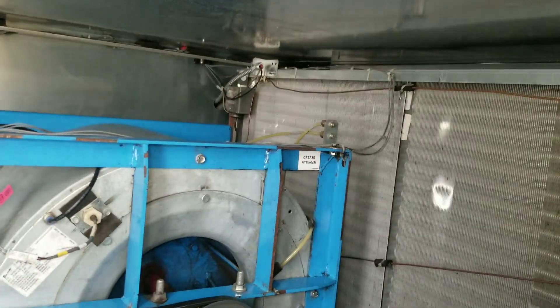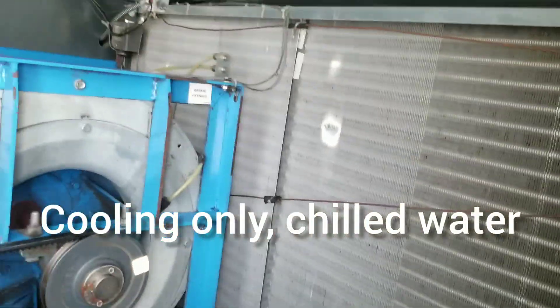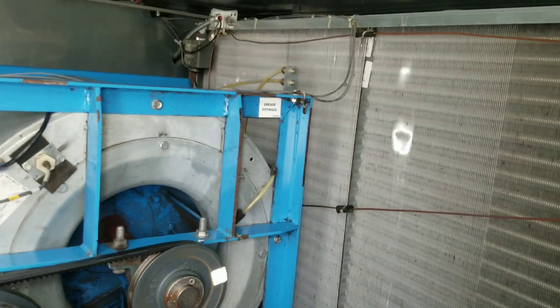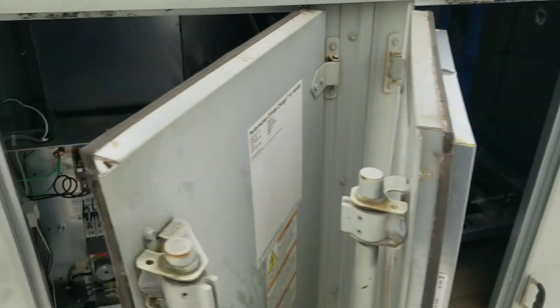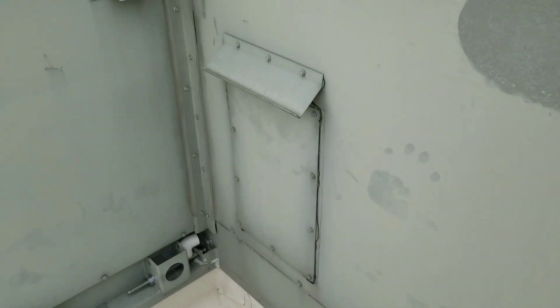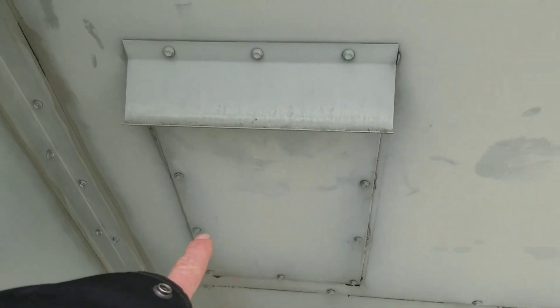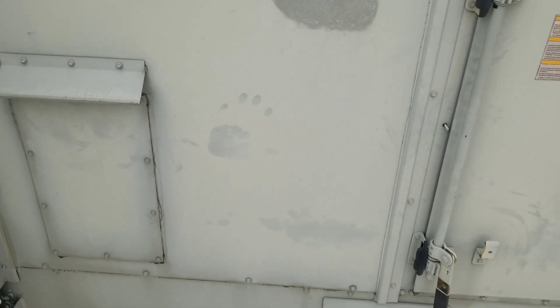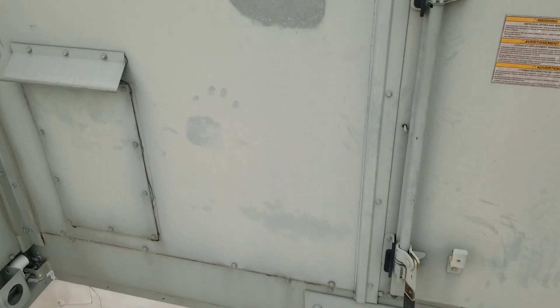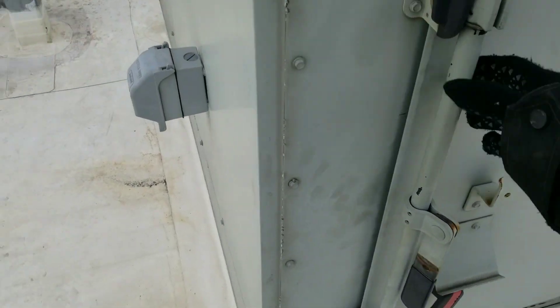I think it's a water coil and that copper tubing goes off — I'm guessing that's a freeze stat over there. It's not real good access. I don't like how they put those in there because I've gotta get this panel off — that's my only access — and the controls are right up in here. So get this panel off and dig into it and see what we can find.